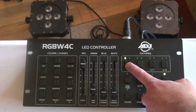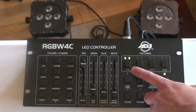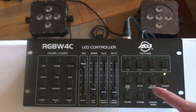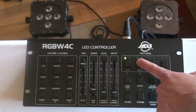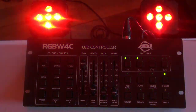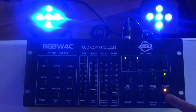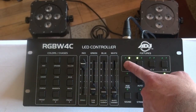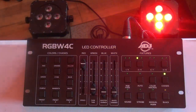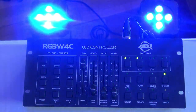Hit this button 1 time and you have fixture 1; 2 times, fixture 5; 3 times, both 1 and 5; 4 times, they're both off. Today I want to select fixtures 1 and 2. Hit the blackout button and they come on — they're doing a chase right now. For demonstration purposes, if I only want to look at fixture number 2, I simply turn off 1 and I'm only working with fixture 2.